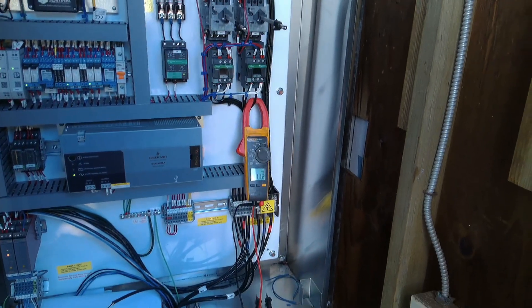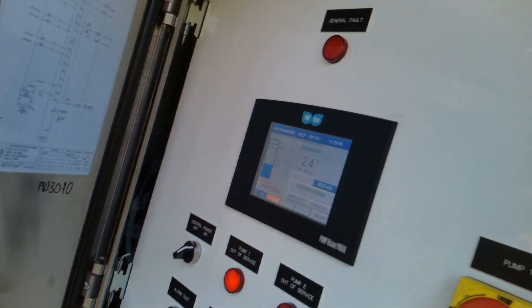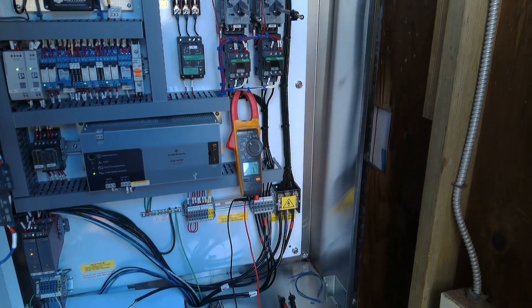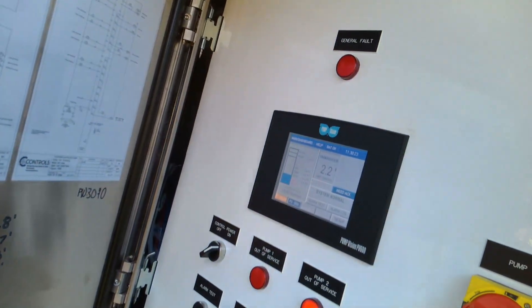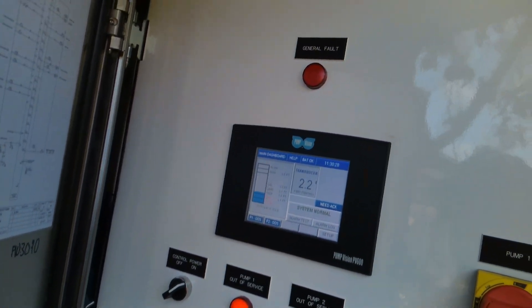About the same, a little higher — 12, 13, 14, 13 amps. 13 amps, level's coming down. About 13. Then very low amps — 7, 8, 9. Very low amps, but the level is falling. Nice, very low amps, quick drawdown. So 9 amps on pump 1.